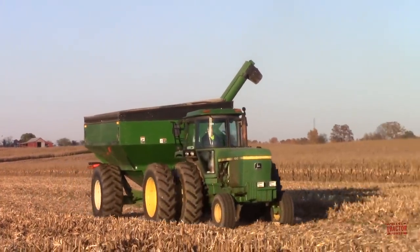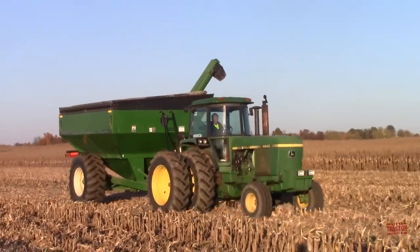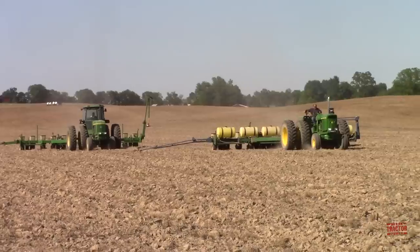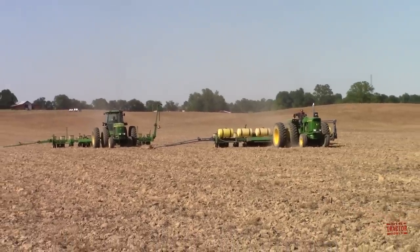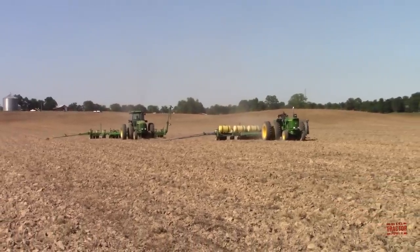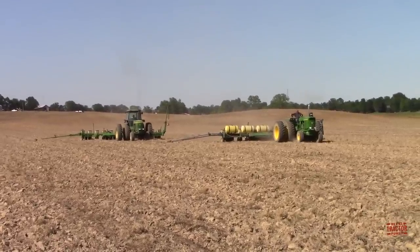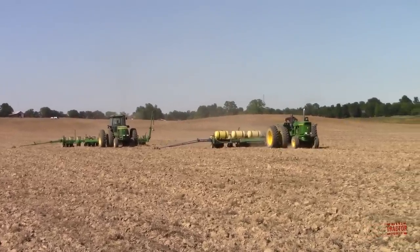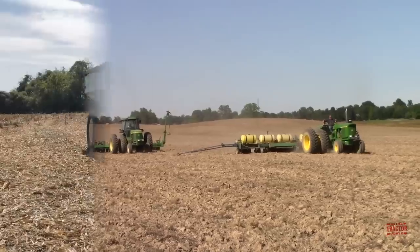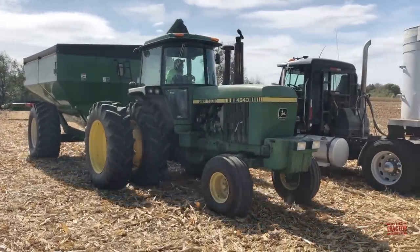This Western Kentucky farm really likes John Deere 46 model number tractors that were manufactured in the 1970s. They utilize a full range of those tractors, including a 135 PTO horsepower John Deere 4620, which was offered from 1971 through 1972, and a 150 PTO horsepower 4630, which was offered from 1973 through 1977. Both the 4620 and 4630 are used to plant corn in the spring, and then this 155 PTO horsepower John Deere 4640 is used on the grain cart during the harvest in the fall.